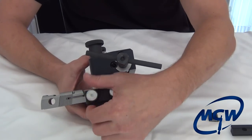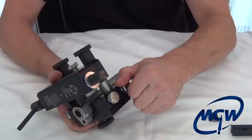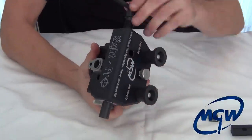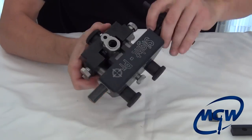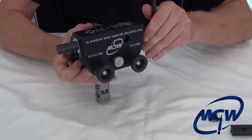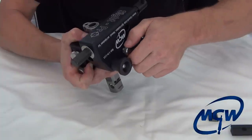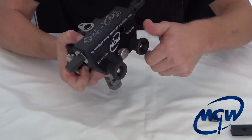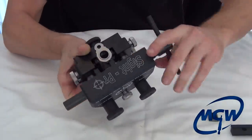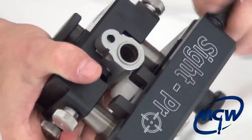With enough carriage clearance, just bring it over, look carefully and make sure you have the clearance you need. If it's a little high, just break it loose a little bit, turn that a little bit, clamp back down and it lowers just a little bit more. And that's about perfect — it's just turning that sight off with no problem.